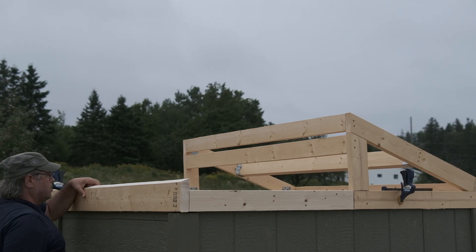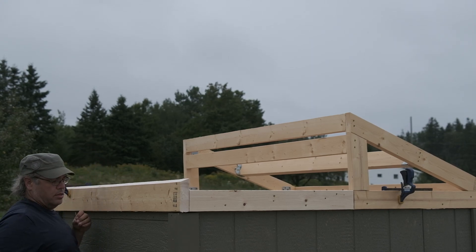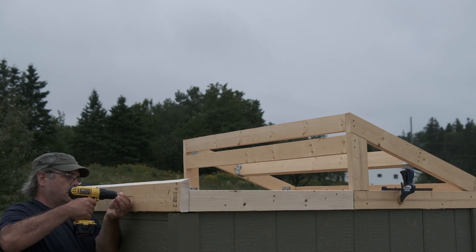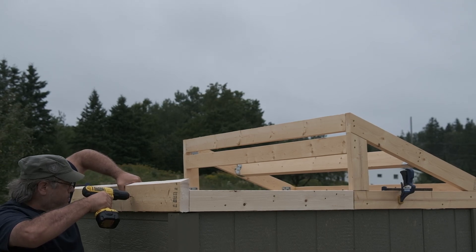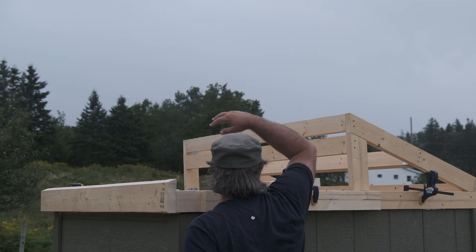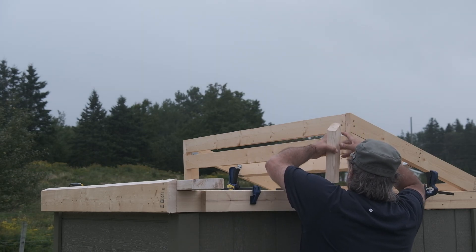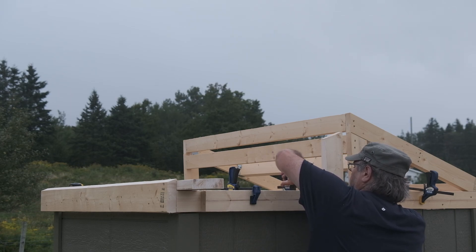I'm taking a bit of a different approach to building the roof than is usually taken. There are not going to be any fancy overhangs — the frame itself is oversized to overhang the main body of the observatory about one inch on every side to form a drip edge, and the structure itself is only 5 feet 4 inches in each direction. I built the structure to those dimensions with a specific plan in mind. If I had gone with 8x8 — the size of the deck I'm standing on — the math indicated that each side of the roof would have weighed about 250 pounds, which would have required sophisticated railing along with some kind of wheel system. However, by making the observatory 5 feet 4 inches, each roof half weighs only 50 pounds.